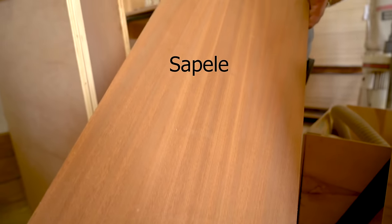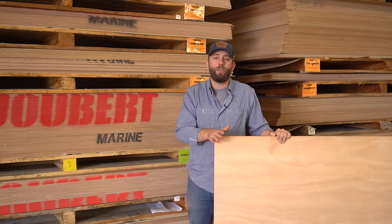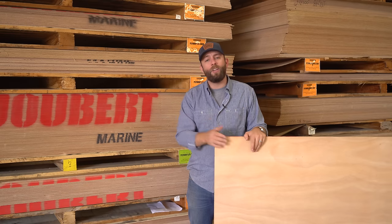For the purpose of woodworking, the two main grades of plywood to talk about are cabinet grade and marine grade. Cabinet grade is perfect for cabinet and furniture making — this is where you find a big variety of different veneer surfaces and numbers of plies, from the widely used Baltic birch plywood to cherry, oak, maple, walnut, and many more. Unlike construction plywood you typically find at box stores, the quality of these sheets is going to be awesome. Marine grade plywood is manufactured to the highest quality, and only certain woods and glues are used to make them great for boat building and marine applications. They're very durable and handle wet and humid conditions better than any other type of plywood.